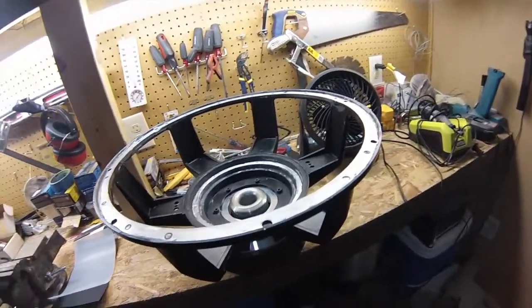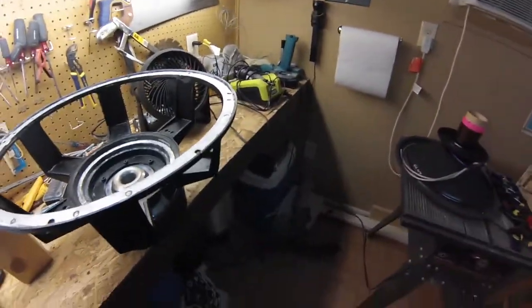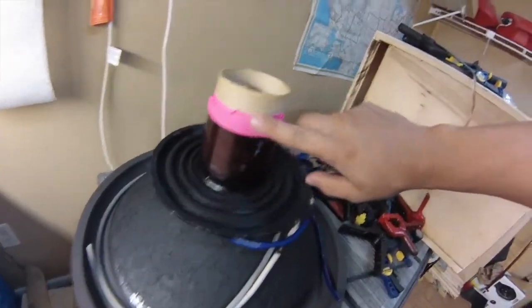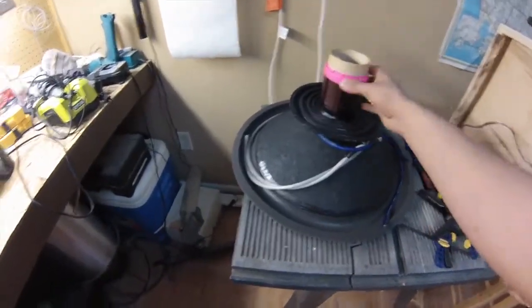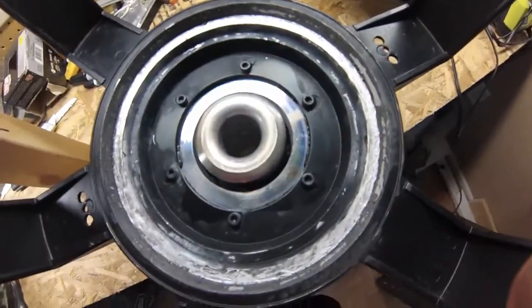Alright you guys, we're going to start the recone process. These are the baskets already cleaned. Now I'm going to show you everything you get in detail when you order a recone kit from PSI. For starters, you get your recone kit — I got direct leads, you can get terminals. You get this little cardboard that goes through the voice coils to stop damage during shipment — you do take this off. Then you also get some shims, little pieces of plastic.